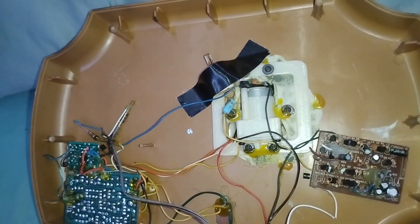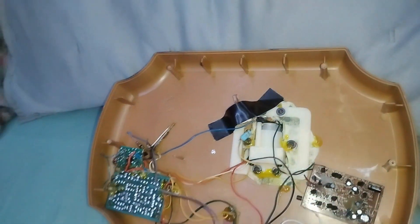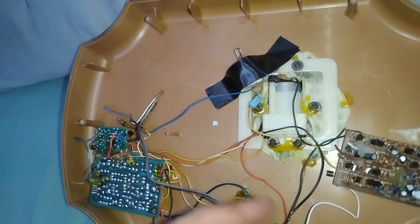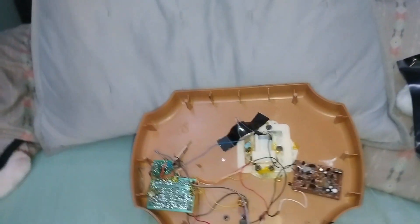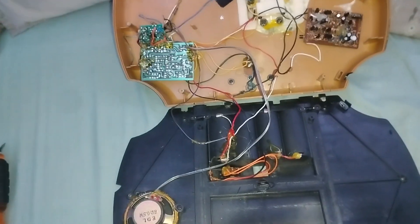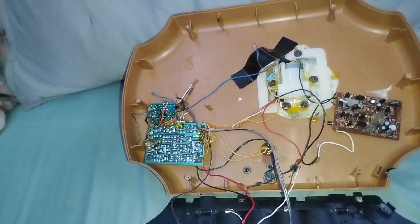How I figured that out: when I ran the negative wire to the mouth motor and the positive to the head motor, it kept moving all the time through the entire song and would never stop. But whenever I did the opposite — ran the positive wire to the mouth and connected the ground up here to the head — it only works when the head turns. So somehow they operate off of a ground signal instead of positive. I don't really understand how that even works, because I thought the transistors output power instead of outputting a ground signal.